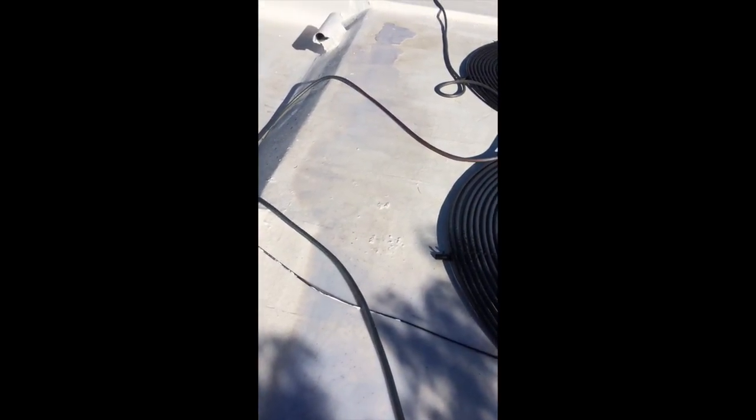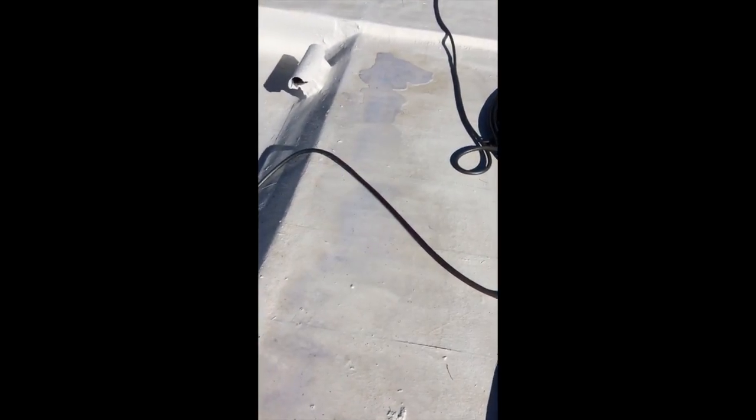You can see how it's dripping down here — this is why I watered it first. Then I'll take the hose and rinse everything off, let it go down the drains. It's not a big deal up here on the roof; it'll only help the roof, but you don't want it to puddle. The water ponds over here as I finish spraying. It's okay if the sealer sits up here — it'll only help — but you don't want it ponding with concentrated sealer. So we dilute it down and let the water dry up here; it'll just help preserve the roof.